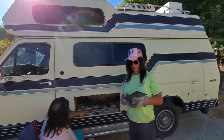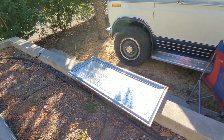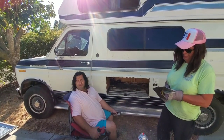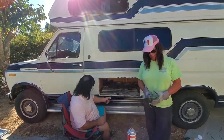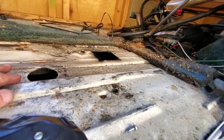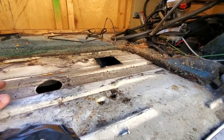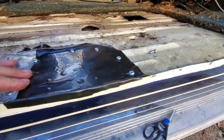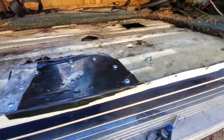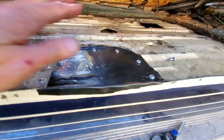I'm working away as the old sheet metal worker here, making some covers for some of the holes for the exhaust and some of the electric and other things in the box. Here's the new lid right over here — a beautiful job on that. The real grunt work of the job is getting this cleaned up and getting these holes sealed up for the exhaust and for the oil drain, as well as some hold-down bolts. I'm going to lay a big piece down here. This was an unusual shape, so I beat a piece into shape and laid it over top. It has double waterproofing: exterior grade flashing, a big piece of sheet metal, then another piece of flashing overcoated and screwed down.